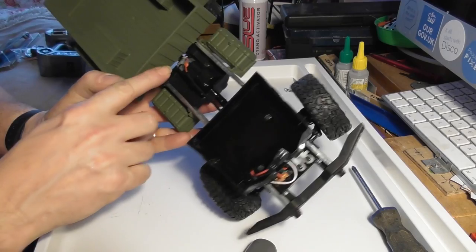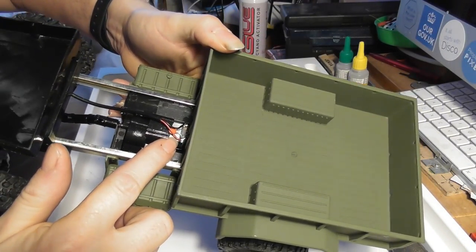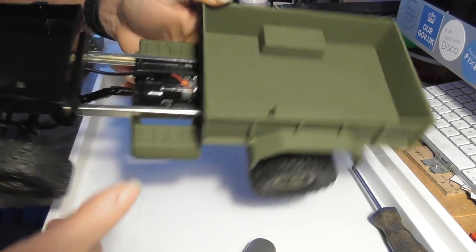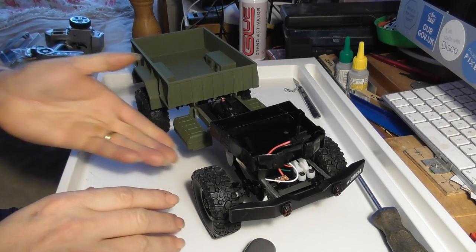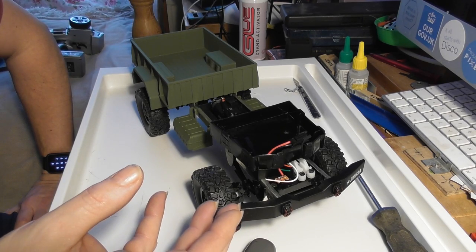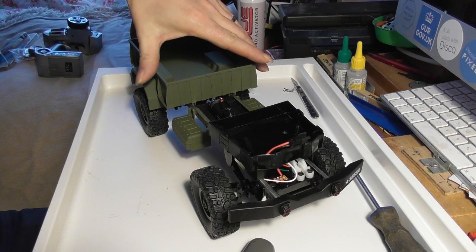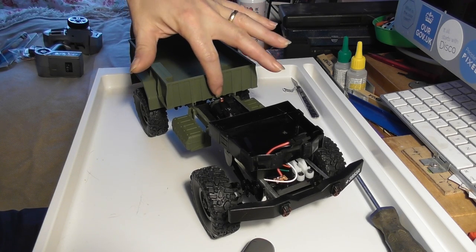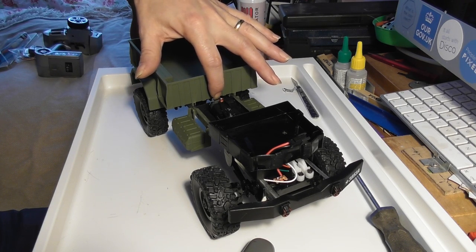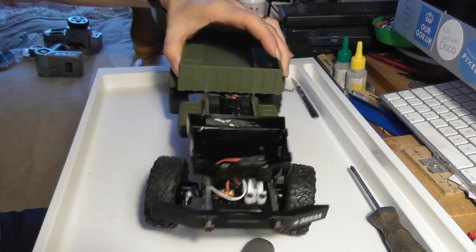Right, so we have here a little motor, which, having seen one or two other people's videos, I know is the same size as a Mini Z motor. That's quite useful, because if I wanted to get a motor with either higher turns or more poles inside it, i.e. for higher torque, a slower running motor, it wouldn't be very hard to replace. And also, if I was to burn this motor out, these are very, very cheap to replace, a very standard kind of item.